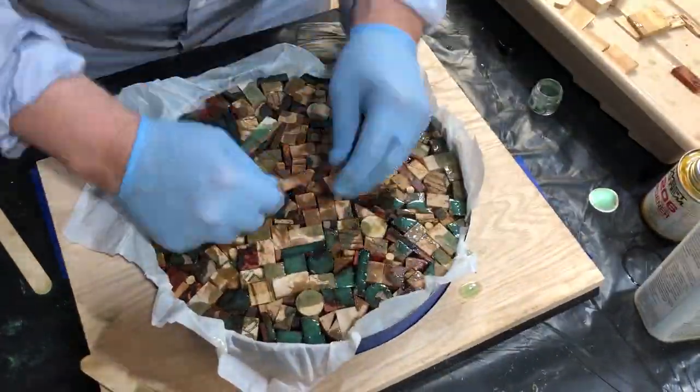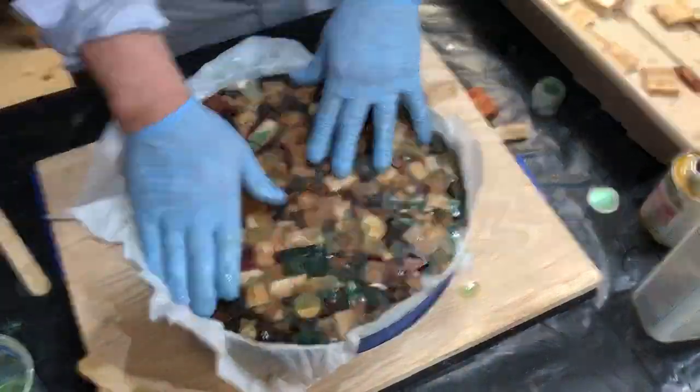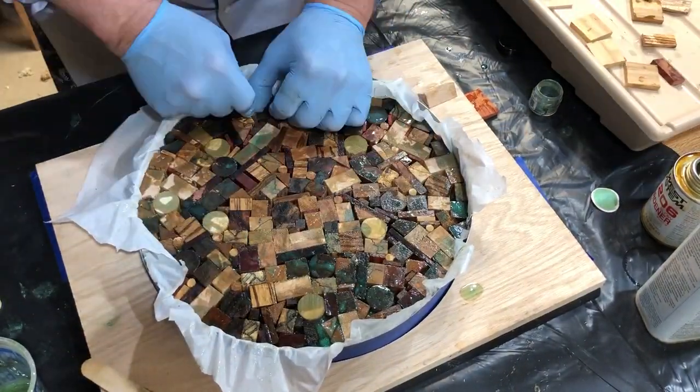I used a green glossy colorant in the epoxy. I left all the pieces in the form loose so that the epoxy would get down to the bottom and start to lock those pieces in. Once that was done, I put in the little pieces and kind of jammed them in there to tighten up the whole form. Off camera, I added about another half quart of epoxy with colorant to fill it up and cover over the entire form.